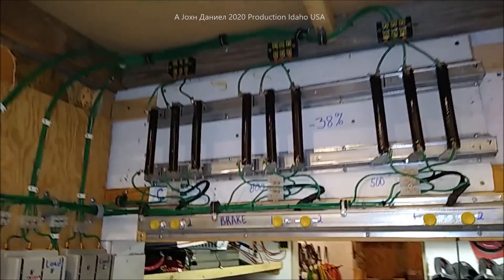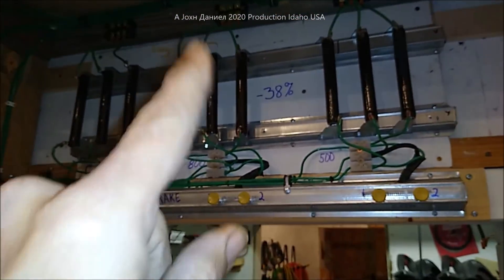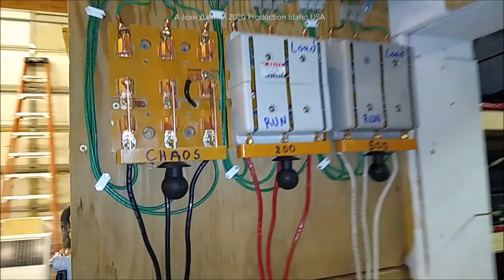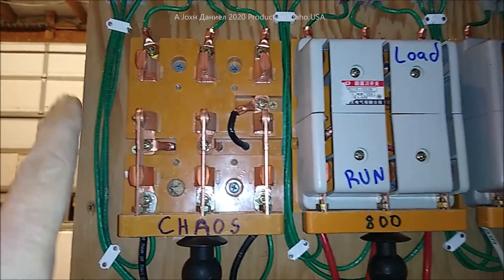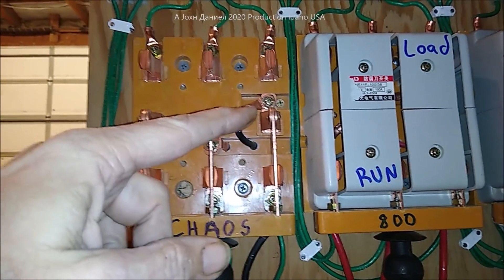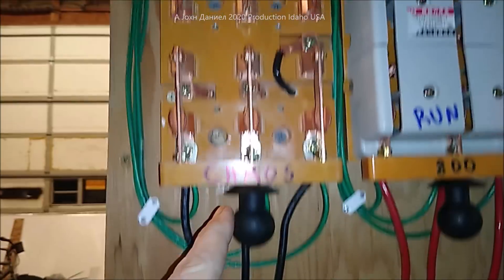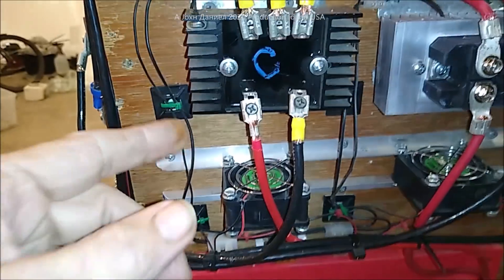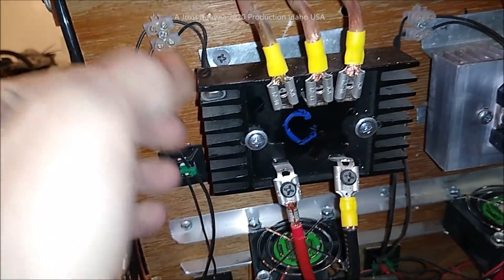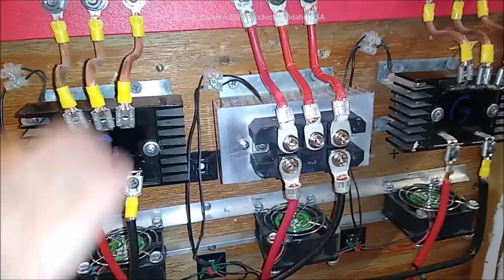Hopefully the picture is helping you. There is incoming at the top, outgoing at the bottom, and the outgoing has the ability to be shorted out against resistors for your braking. Incoming is in the center — so your center pivot points of your blades is incoming from the turbine. To run straight through, you just pull the blade down, it goes straight through and into your system. I have thermal switches for my heat sinks on the outer of my rectifiers right here — it kicks on the fans. You can hear them all running right now, and that cools the rectifier.